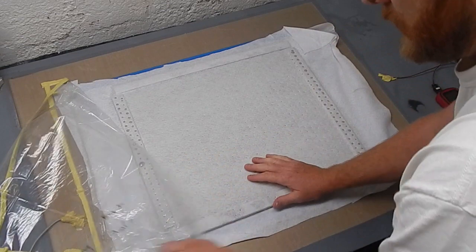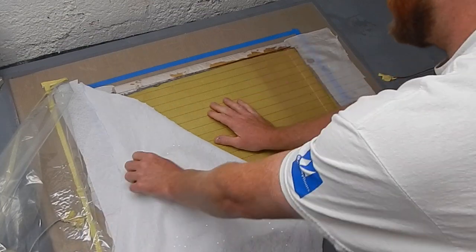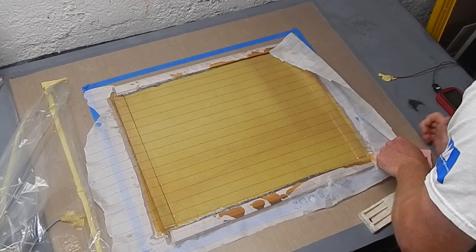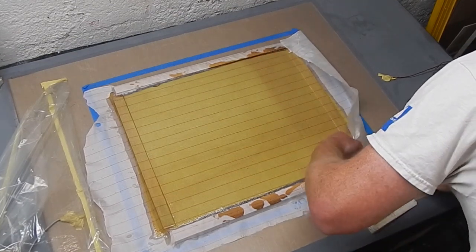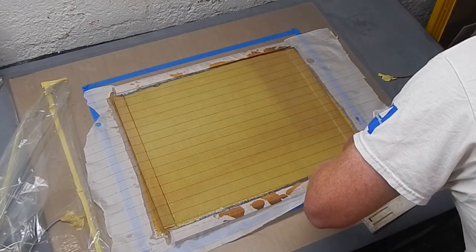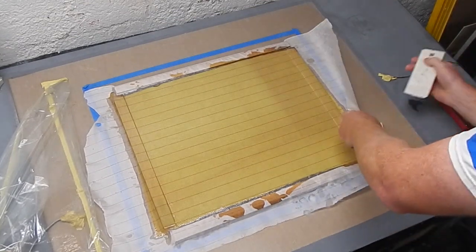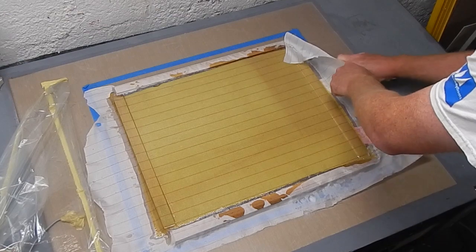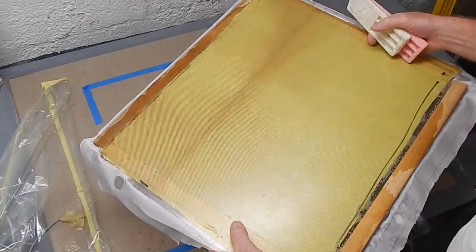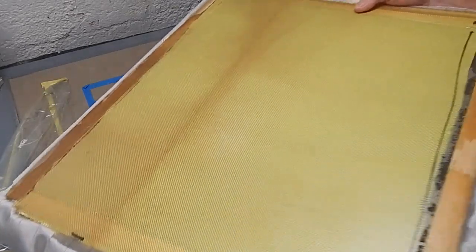And here it is. You can see it didn't bleed an awful lot — probably a fair bit of resin in the cells. We'll see when we cut the honeycomb. I did not make a great deal of effort to get the resin out of this. If you see laminate sample number one, it was a similar outcome with carbon and Nomex, but I did that in two shots and really tried to limit how much resin was in it to see how light it could get. This one I just went with it. Much less pin-holey than laminate sample one or some of the others.